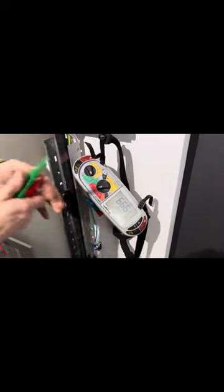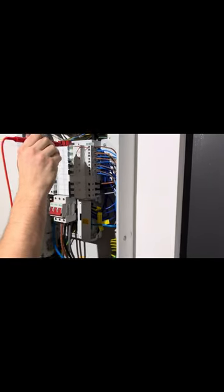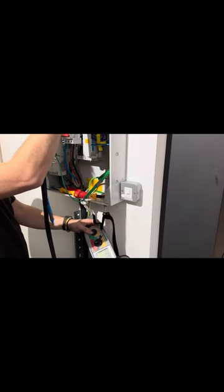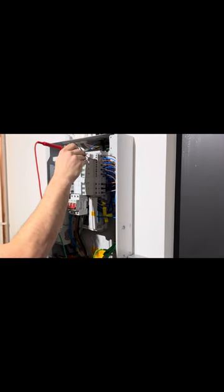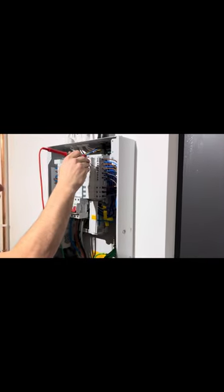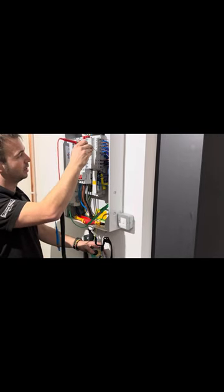Test, lock it on the MET. Now I've connected all the CPCs just to check there's no damage between any of the other circuits or cables. Good, good, good, good - I'd expect it to be all perfect anyway.